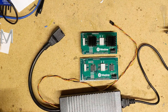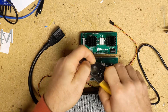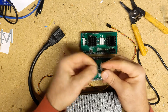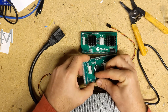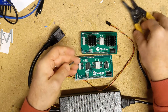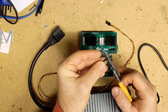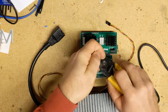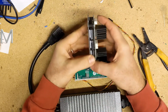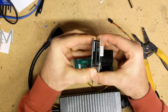So what we're going to do is find auxiliary one. We're going to cut our pin header to three pins and fit that in the board. This is a version 1.2b Maslow shield right here. I have another one that's connected to the Arduino, so we're going to cut two sets of pin headers — one of those has the heat sinks and the other one does not. In order to solder them on, we have to separate the Arduino from the shield. The Arduino is on the left, the shield is on the right.